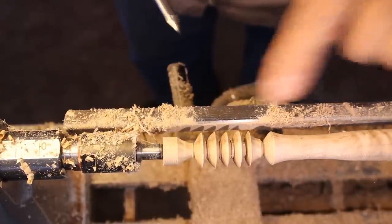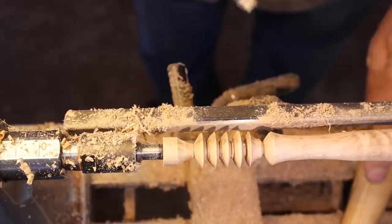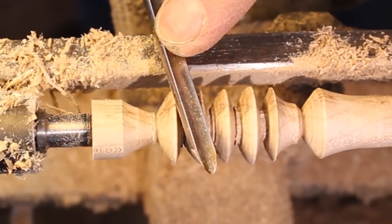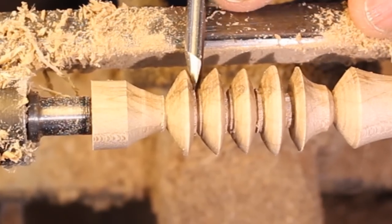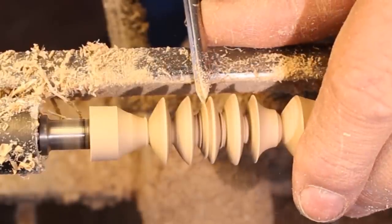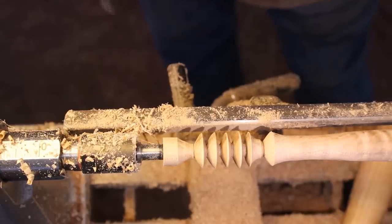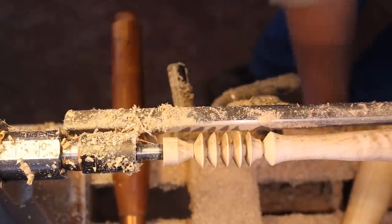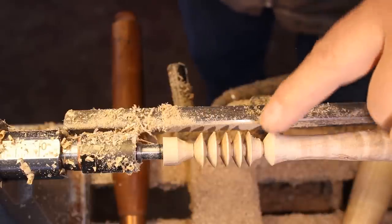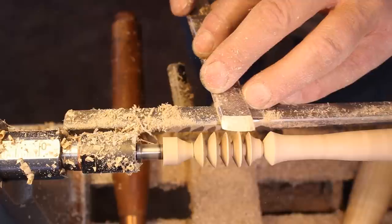I'm finding this end of my honey dipper a little on the clunky side so I need to lighten that up a little bit. I've been using this detail gouge and still can't get into those grooves very well, so I've got an old tool that's been with me for many years — pretty worthless as any kind of gouge except I've got that profile at a very sharp angle and I'm going to get down there with it. This really is the best tool for this job. I really need to back up this honey dipper with my left hand. The last thing I'm going to do is take a skew chisel and just take off the very tips of those grooves and make them a little bit more square — if I leave them sharp to a point they might tend to break off.